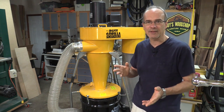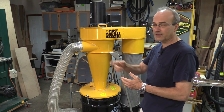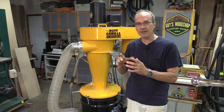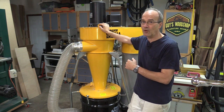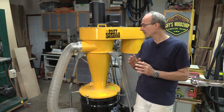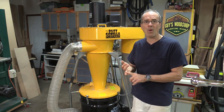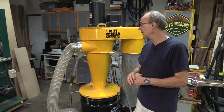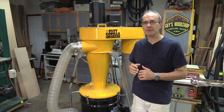This is huge. For example, I use my dust collector hooked up to my CNC machine with only a 2.5-inch hose. My DeWalt thickness planer has a 4-inch fitting but actually a 2.5-inch port, and from practical use this new machine does a lot better with that planer than my old one did. The bottom line is that the Oneida dust collection system with SmartBoost technology has real advantages: less CFM drop at the machine due to hose size, bends and elbows, port size at the machine, and how dirty the cartridge filter is. If you're looking for a new dust collector, I highly recommend the Oneida Air Systems with SmartBoost technology. Thanks for watching and we'll see you next time.